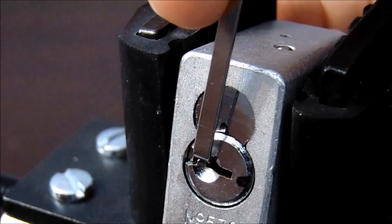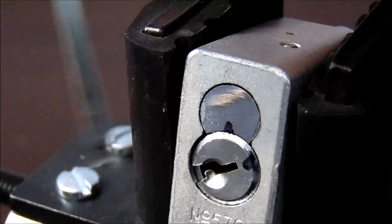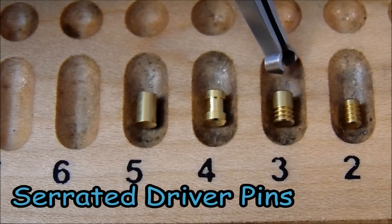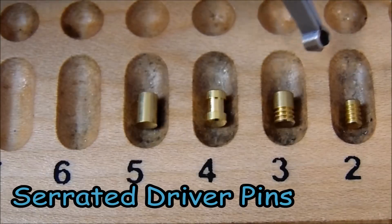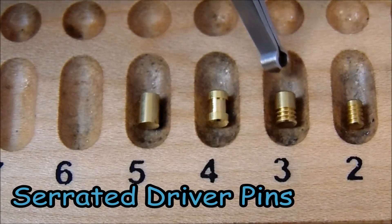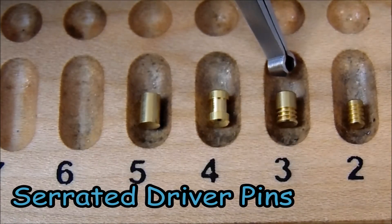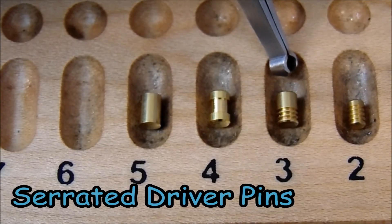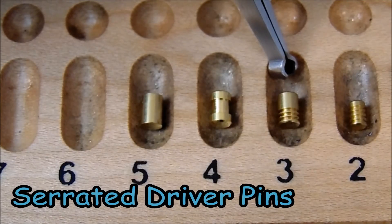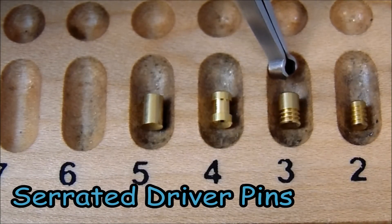The lock opened. When I set the counter-rotation, I let it push back against me as I was lifting, but I was still tensioning in the direction I needed to get the lock open. In positions 3 and 2, these are two examples of serrated driver pins. This one is kind of half-serrated — when you look up the body, you can see all those fine serrations. And this is a serrated driver pin from an American lock, very finely serrated all the way up through the top. When you're picking these pins, light tension is a must. They give very good feedback — you can feel them clicking up each way into position — but since you have to apply rotational force to set pins, these can get very stuck up in the plug and Bible and be very difficult to lift to the shear line, and many of them get stuck in the underset state. You've always got to be very careful with your tension.